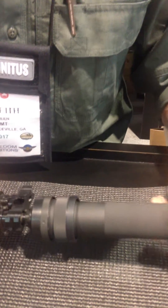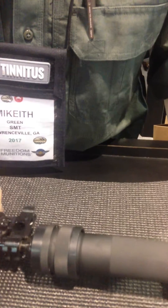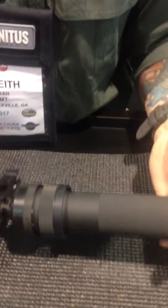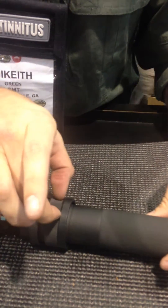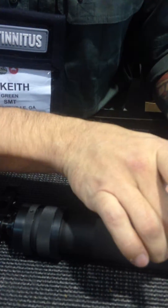The next thing we do is design the baffle stack so it is cut conically to accommodate for those looser tolerances. The first baffle on a normal one is right at about 33 caliber, and it tapers out to about a 46 right here.